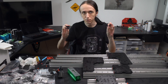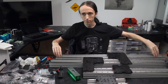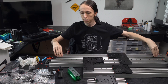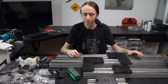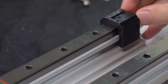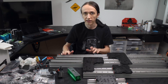They tell you to use these little 3D printed guides to align the two sides and then tighten one of the rails down. Now, if you're building this machine as a wood router that is cutting out signs, go ahead, follow their instructions — you'll be perfectly fine. But if you're trying to get the most out of your machine, this is not enough. These plastic pieces have quite a bit of slop in them — there's probably almost half a millimeter of slop — but you can still push the rail back and forth. So it will get it centered enough to where it's not a problem, but it's definitely not an alignment tool per se.